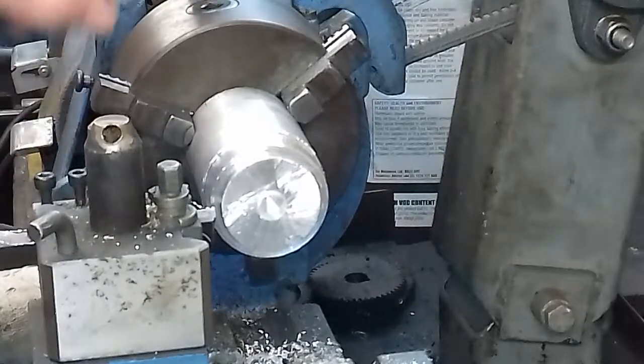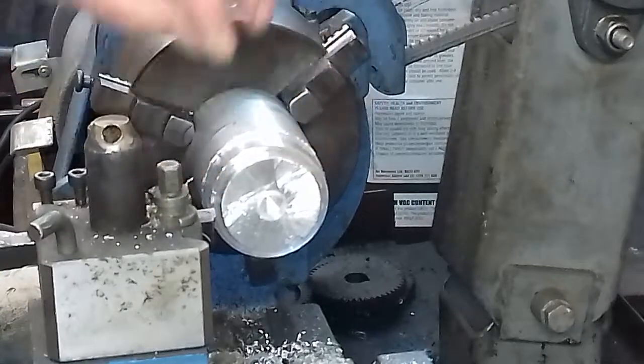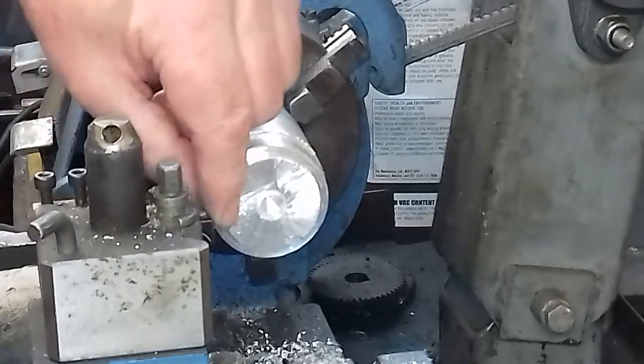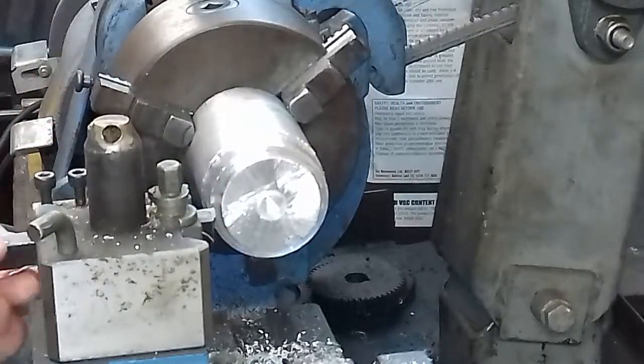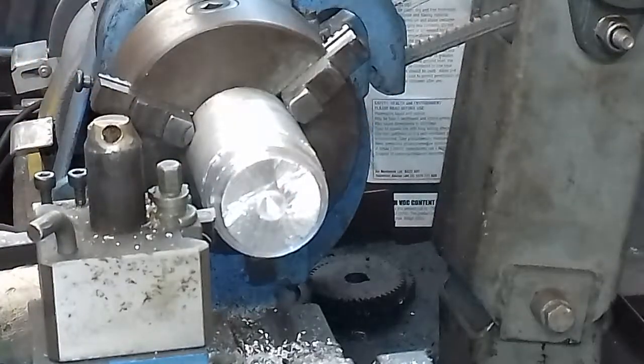As you can see, I can only take a small cut at a time because the lathe's really old. I think there's a bit of play in the bearing on the headstock — it starts chattering. Normally you'd do a couple of roughing cuts and a finishing cut, but this one I have to do about a hundred roughing cuts. I'll just quickly face it off there and start measuring it to get it done.